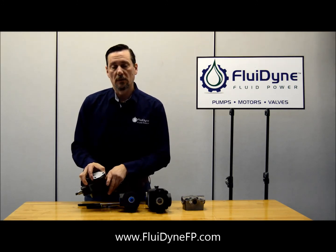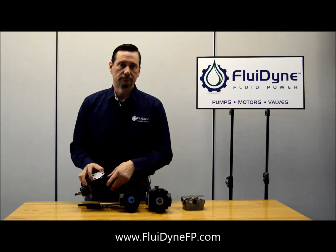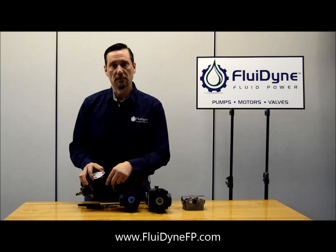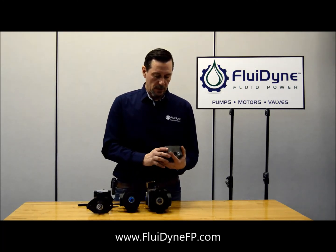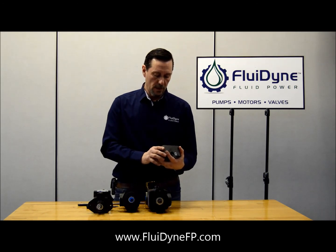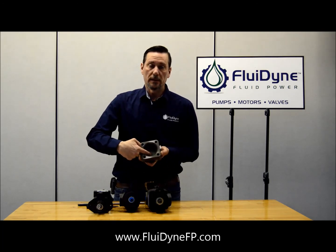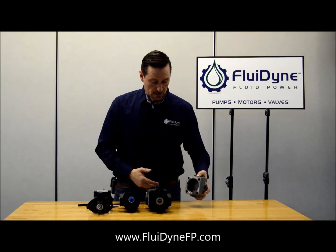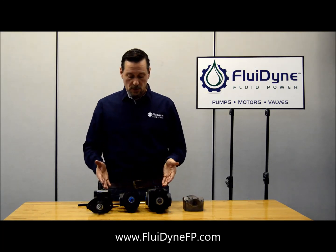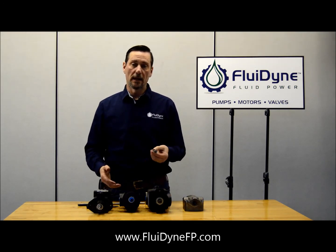VTMs come with an orifice plug, so you can pretty much change whatever flow rate you need just by changing the plug and the orifice hole in that plug — it's very easy. The V20 priority cover orifice is down inside the cover, so you have to remove the cover and drill out your hole right in here to change the flow rate through the orifice. That's how you change your internal relief valve and how you find out what the pressure is on it.